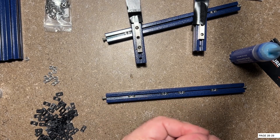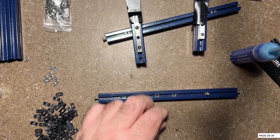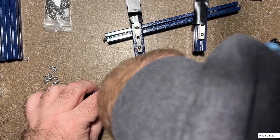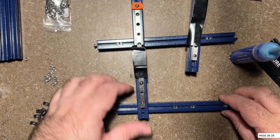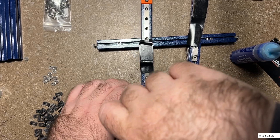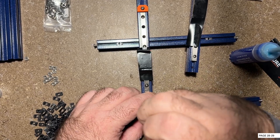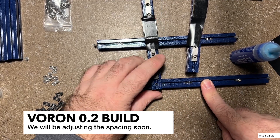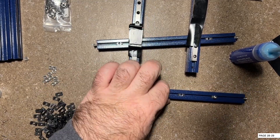Just imagine doing this with nuts flying everywhere - that's what you would have if you weren't using these. They do take a little more time to insert, but that gives us a good spot to go ahead and attach the M3x6 button head screws. I'm going to put these into the two outside preloaded nuts, just go ahead and do a few turns on those. They don't need to be super tight because we're going to be fitting our extrusion over them. Now you're just going to take this, slide it over - I've got it sitting on the top extrusion, and then you should be able to access the screw underneath. It should line up perfectly so the bottom is flush.